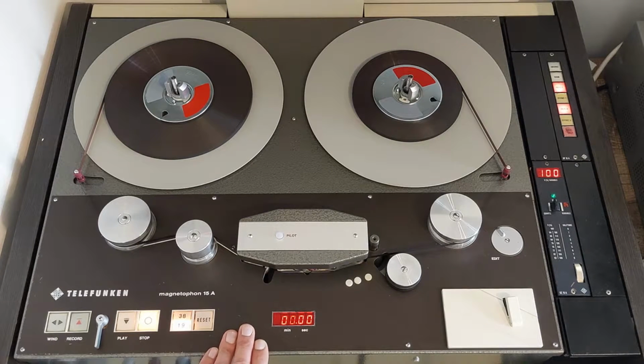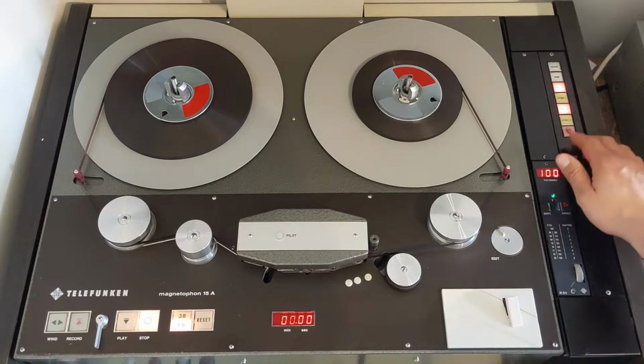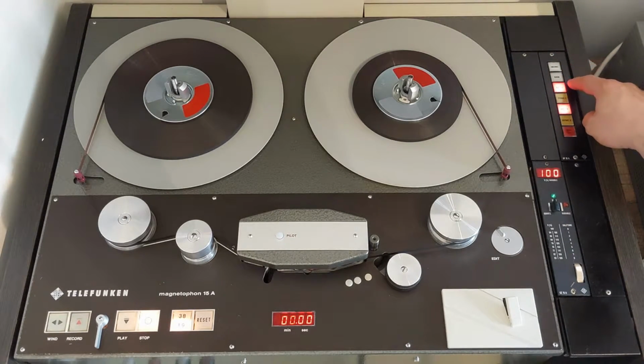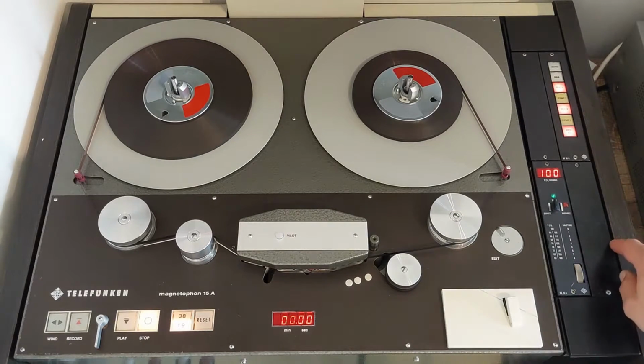Secondly, this machine has a few options that are also not standard. On this side we have the SP15A selection panel, and here we can select mono or stereo, NAB or CCIR, recording on channel 1, recording on channel 2. Recording of the time code we can also select on this machine, and the sync buttons, but they are not connected right now.